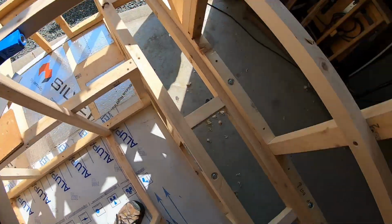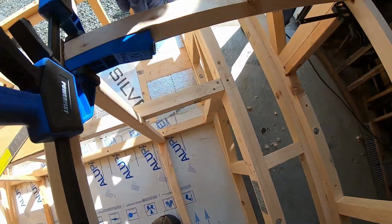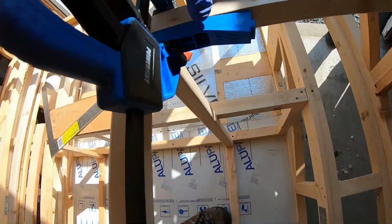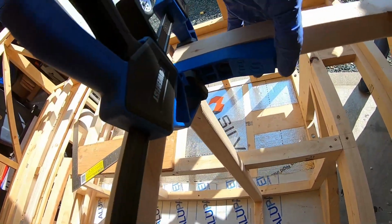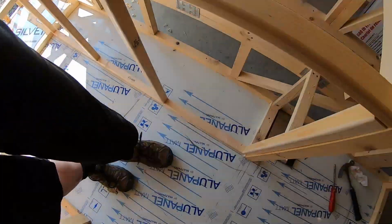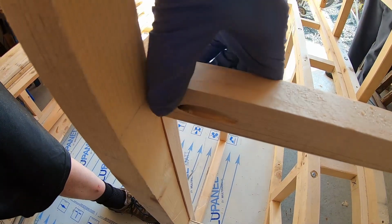Okay, so I've got the back brace put in here for the countertop, and I'm trying to connect it here to the front face of the cabinets. So if you see there, I've got my Kreg Jig and I'm just drilling a hole. I actually did one back here, and it makes it nice and tidy, nice and neat. Yes, indeed.